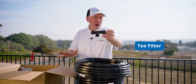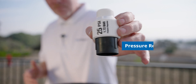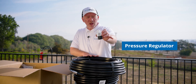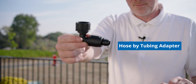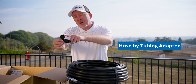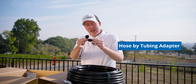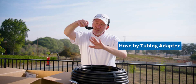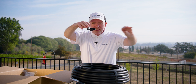This is probably the best choice for a faucet that's close to the ground. Next up is our 25 PSI pressure regulator — 25 PSI is the optimal operating pressure for half-inch drip line. Finally, the last piece of our head assembly: our hose-by-tubing adapter. What this does is connect your mainline tubing on one end to the rest of the head assembly. We went with the elbow shape because of that low-to-ground head assembly — if this last part is resting on the ground, it's already in the perfect spot to accept our mainline tubing.